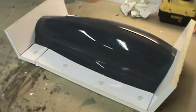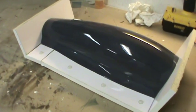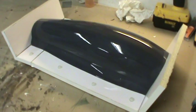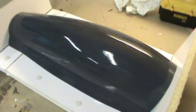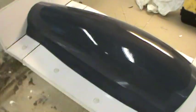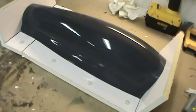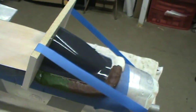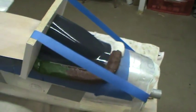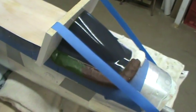This is actually going to be the mold to make the plug that the vacuum-formed clear canopy is going to be pulled from. The canopy is going to be a little bit larger than this because it's going to be formed on the outside. Once it's done, this part will be recycled or just put aside in case I need another one. The bottom part will actually be retained for the second half of the mold — that'll be the actual canopy frame with all the detailing on it. Same goes with the windscreen: once it's molded, I'll make a plug from that mold, fill it with some foam or casting resin, discard it, and then all the detailing will go on with lithoplate around the windscreen area.